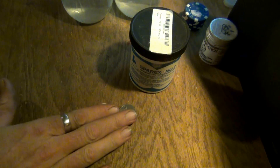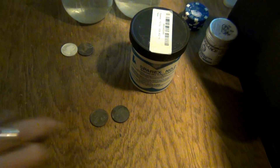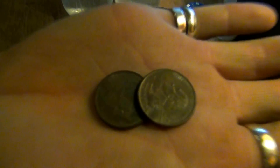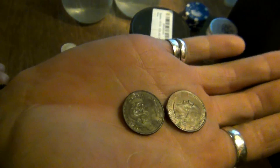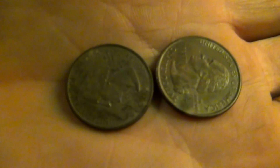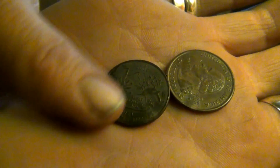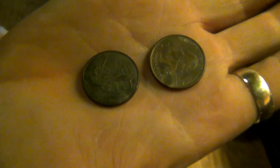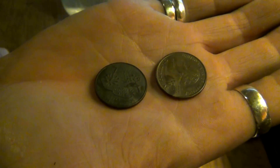Now let's talk about silver versus copper. That's silver — that's how silver looks after the acid bath. Big difference. Now copper — not really a huge amount of difference. These are two copper quarters, both annealed, one dunked into fresh water, the other into the acid bath. You can see there's not much difference, but if you look close, the coin quenched in acid has more discoloration rather than that heavy carbon. The fresh-water coin is really black with a lot of carbon on it. The acid-quenched one has more just like discoloration — lighter. There's a little benefit using acid with copper coins, but the real deal is most noticeable when you're working with silver.